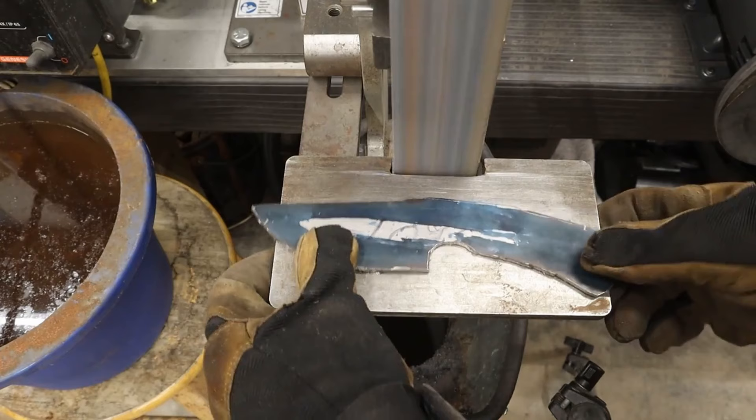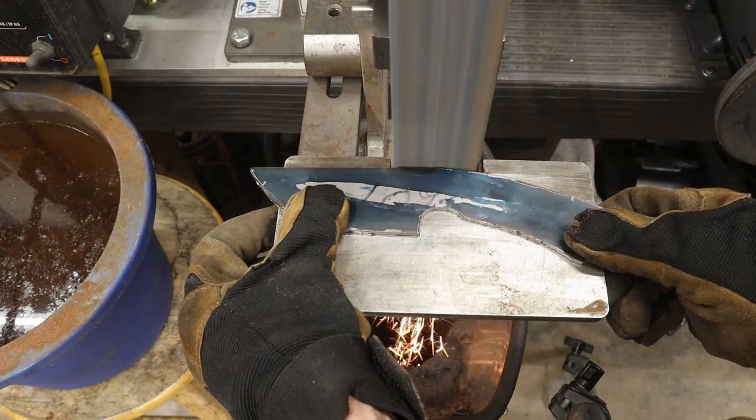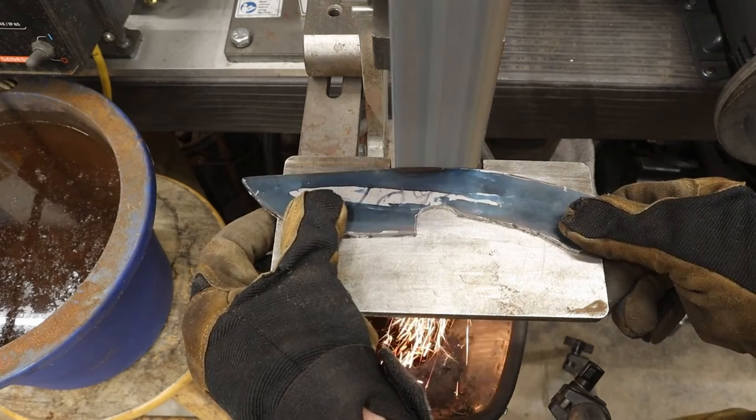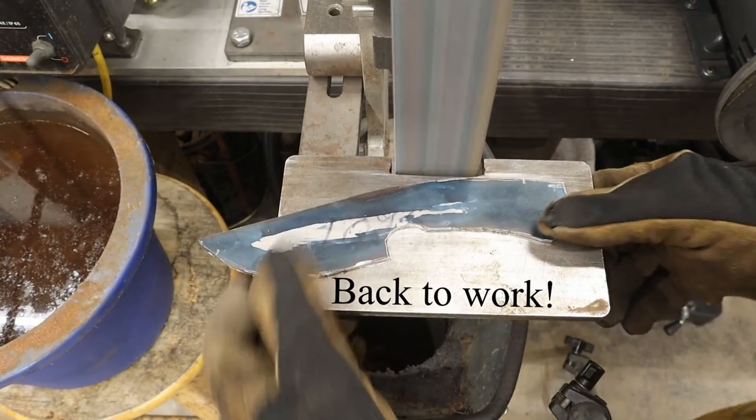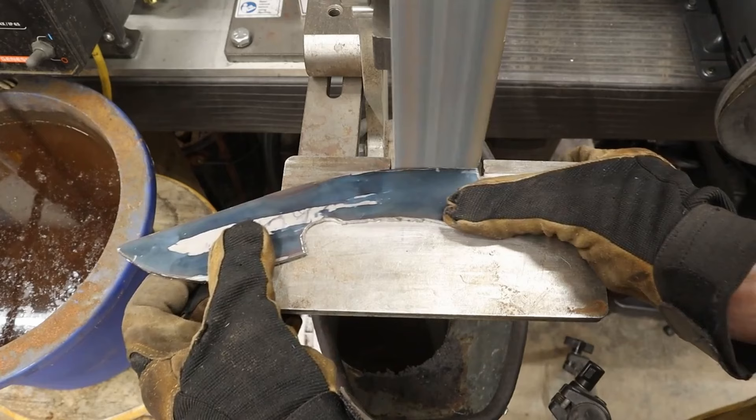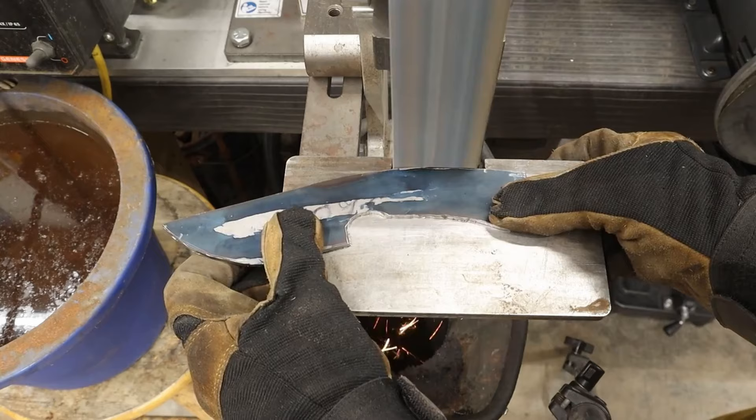This principle is 100% the same depending on whatever type of sanding machine you're using. Basically, if you keep your material at 90 degrees to the belt, you're going to get that nice, crispy edge. A year later and I still haven't replaced that circuit breaker — shame on me. Had to run downstairs and flip the breaker. Back to work.